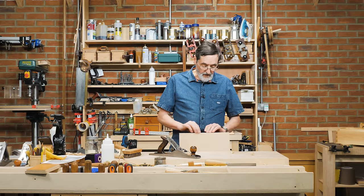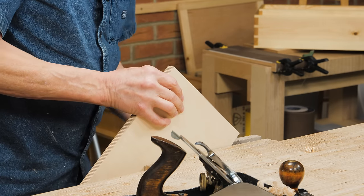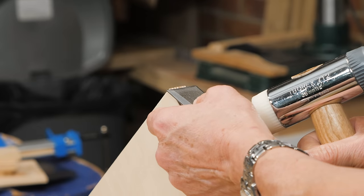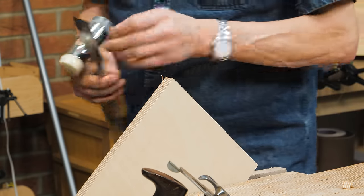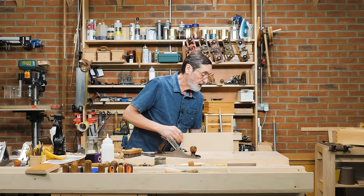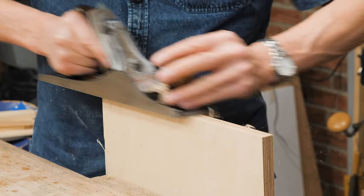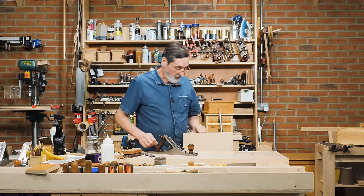When planing the edges of plywood, sometimes we can get fractures on the out-cut. What I usually do — and it works well — is take a chisel cut right across the very corner, just pop it like that, then up-end it ready for planing and take your through cuts like that. You get this nice crisp corner that looks perfect.